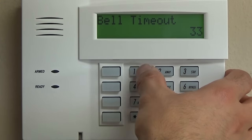And so star 53 is going to be a 0. Star 54 is going to be a 2. And then we jump to star 55. This is going to depend on how your system is laid out. If you have a cellular communicator, you're going to input a 1. If you have a telephone connection, you're going to input a 0. So for this, let's just say that you have a cellular communicator. We're going to input a 1 there. And then we are going to pick up the next video on star 59. That's where we'll continue. That gets into a lot of different trouble reports and how to report low batteries, stuff like that. That'll take us right through star 95 on the next one.